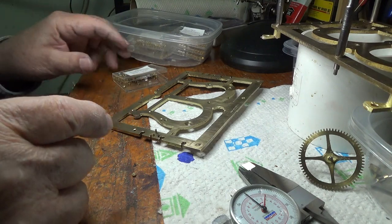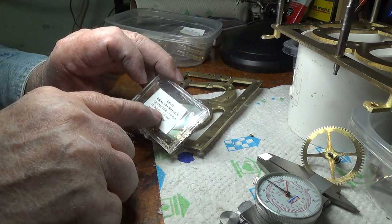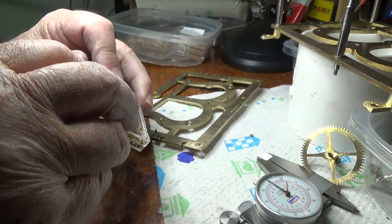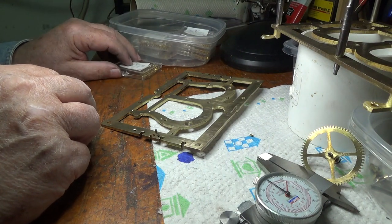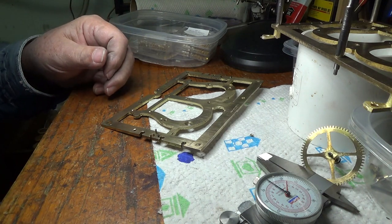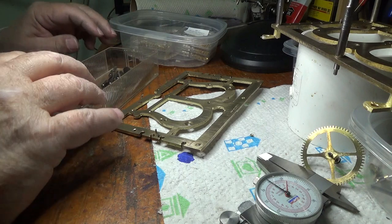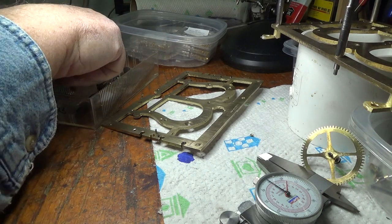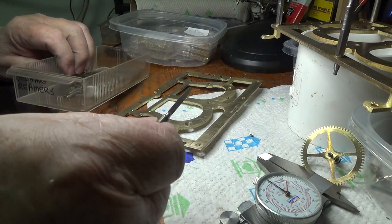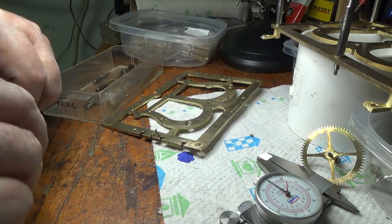So now for the 1.25 millimeter bore, the outside diameter is 3 millimeters, and so I need to get a reamer that's going to drill out that size hole, just slightly smaller actually. That's just 3 millimeters I need. The reamer that I'm going to use is 2.97, and here's a 2.97 reamer. Let me see the number on that.